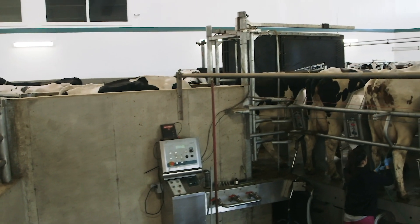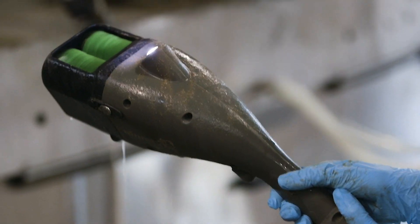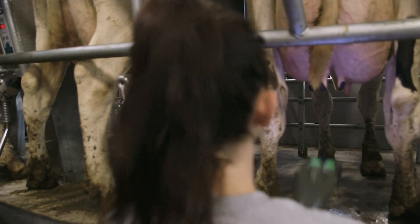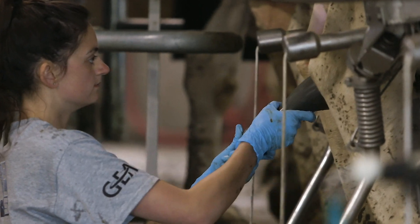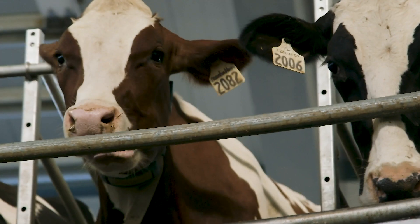This is the future cow brush. Basically it's a bunch of bristles that are spinning. You pull the trigger and it's going to clean each teat individually. First it sprays some water with some cleaning agents. After it cleans with the water, when you let go of that trigger, it's going to shoot some air to clean each teat as well and blow dry them. That way you don't have that water residue dripping off of each teat.